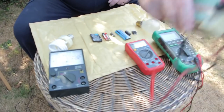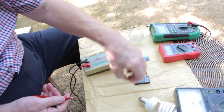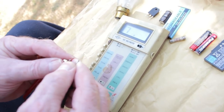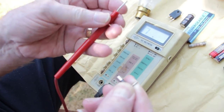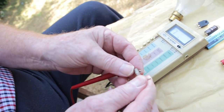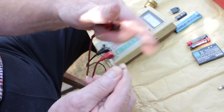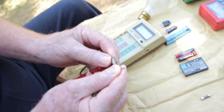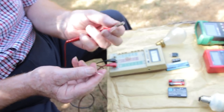Continuity is what it says on the tin — continuous. So you have a continuous circuit. In the concept of a fuse: that fuse there is open circuit, there is no continuity — electricity cannot flow from that pin via the fuse to that pin. Now this fuse we hope is a good one. That is a good fuse. So now electricity is continuous from that pin via the fuse into that pin — therefore it is a continuity test. That tells me that fuse is okay and will pass electricity.